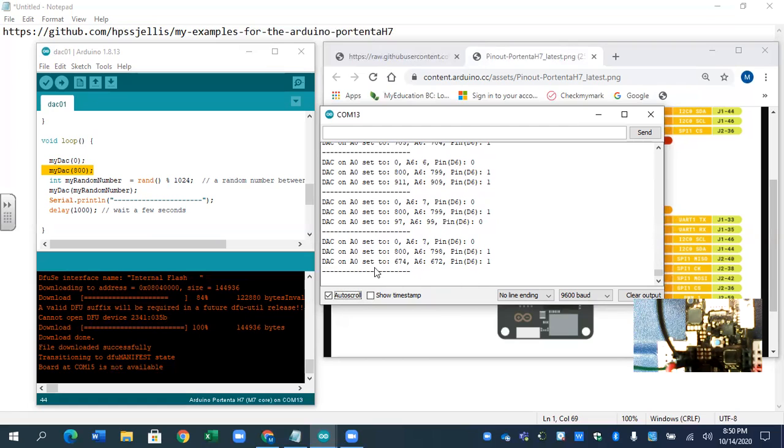See, these are pretty good. Now, I don't know what voltage is actually happening there. Just getting the software working was hard. There, 1022. And it read 958. So it drops off quite a bit right at that last 100 or so. It's good to know. And it would be interesting to see, from a voltage point of view, whether you actually get to 3.3 volts or whether you max out at 3 volts. Anyway, we're done.